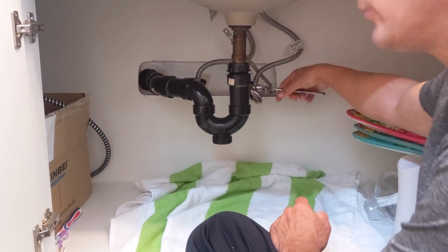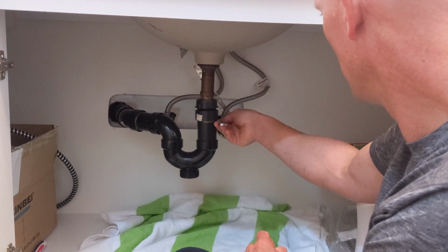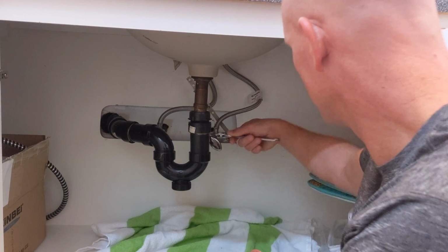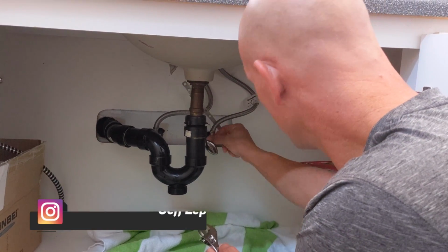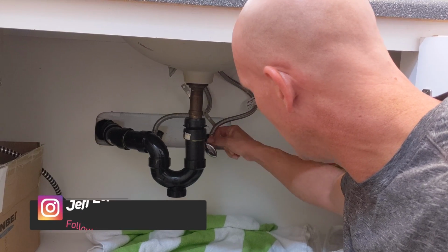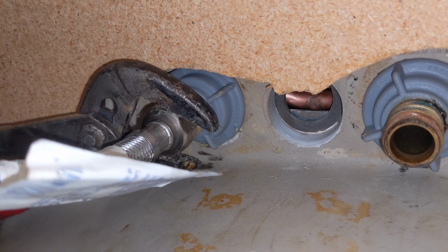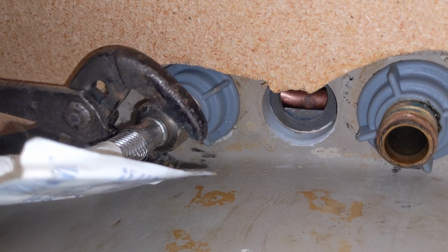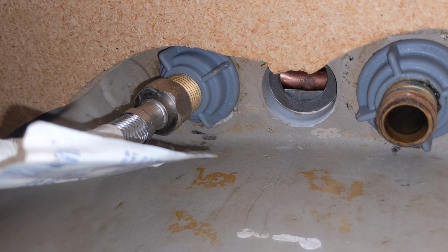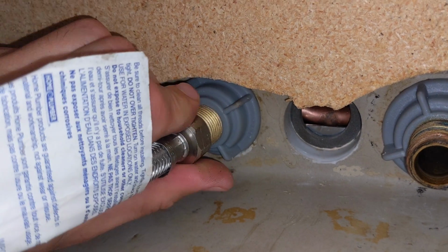And if it gets a little bit looser, you can just use your hands if you can. Like so. And we'll do the same thing for the hot line. So now the water line is disconnected from the supply line. Now I'm just going to use my channel locks to loosen and take off the water line from the faucet above.